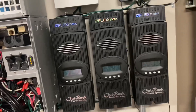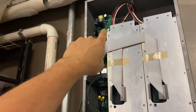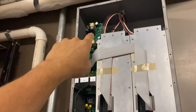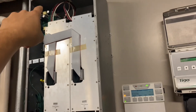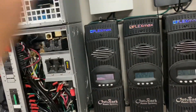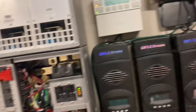Just counting parts on Outback: one, two, three charge controllers, a GSLC, an Outback router, an Outback inverter — which is bad, by the way. They had widespread failure of the power supply board on their early inverters. This one's dead and they're telling me the spare 216 doesn't exist anymore because they only had five-year warranties. Solar now has a 10-year warranty.